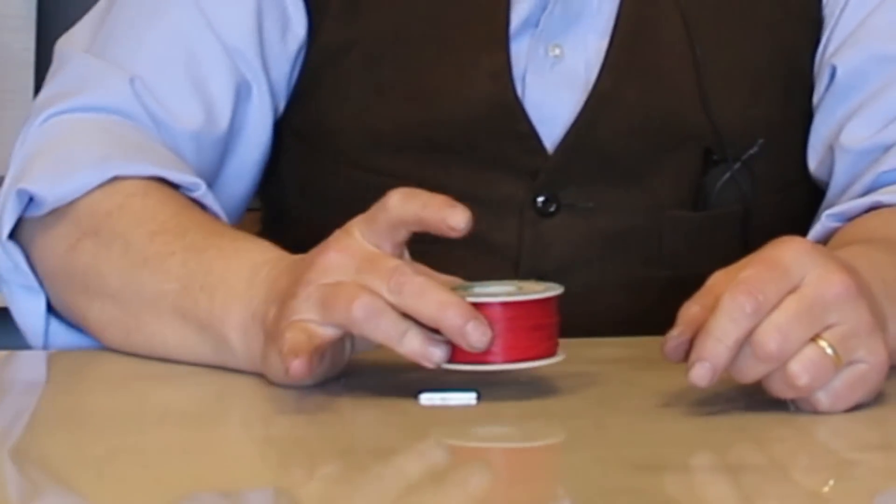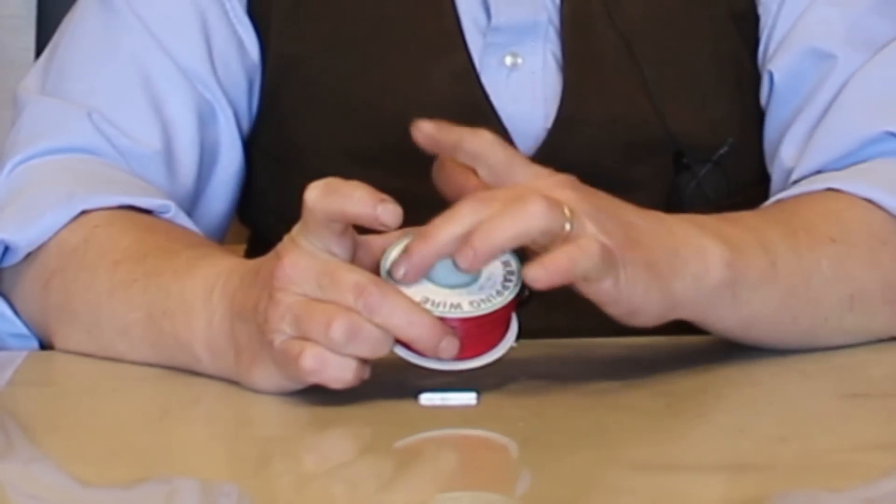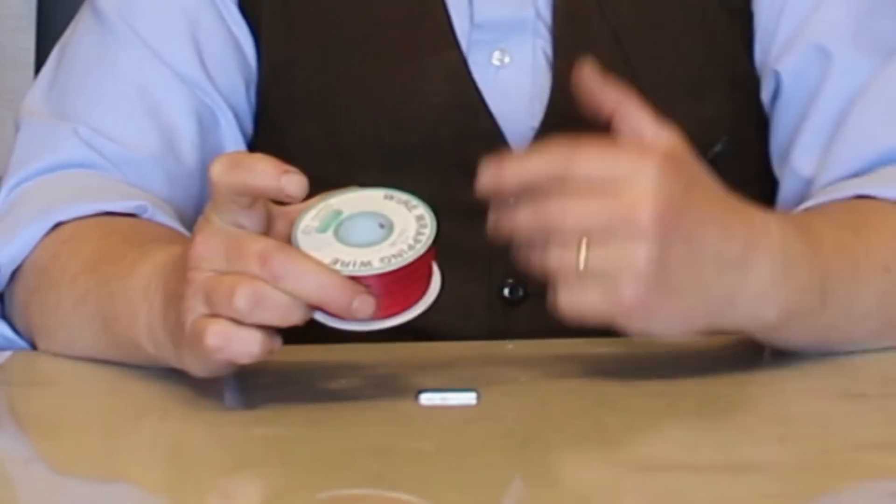There is a bit of method to this madness. Everything has to be at 90 degrees — the wire has got to be at 90 degrees to the field, and the direction of movement is going to be at 90 degrees. What it means is if I take a coil of wire like this, which is basically what you find in every single motor and generator in the world, only this bit and this bit are going to generate. This bit and this bit are going backwards and forwards — they're doing absolutely nothing in terms of generation. They are linking everything together, and that's why you have them, but they don't generate anything and that means they pull down the power-to-weight ratio because a big lump of copper is doing absolutely zip.